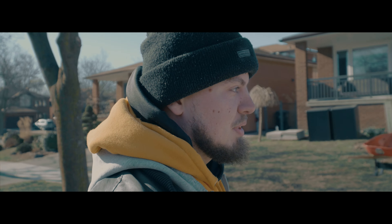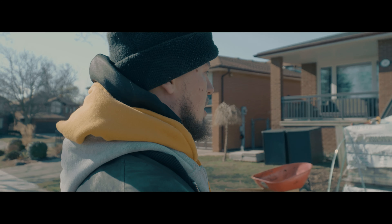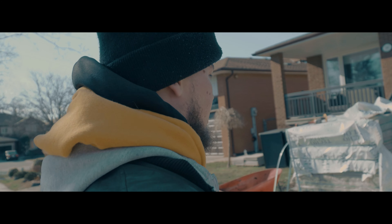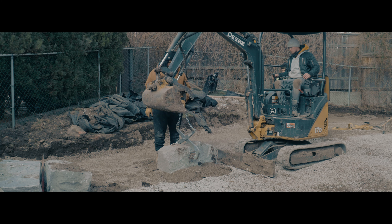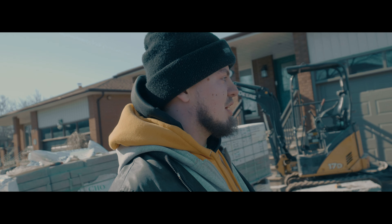So last week, if you remember, we were having trouble putting in the armor stone wall because the excavator wasn't able to pick up the stones — they were slipping off. So we customized the gripper, adjusted the size, added a little bit more grip so we could pick up the stones, and after that it went pretty smoothly.